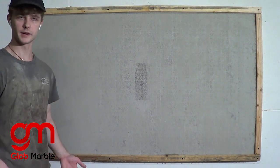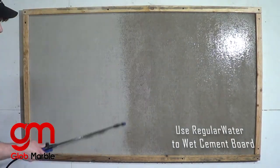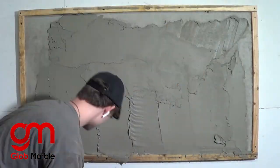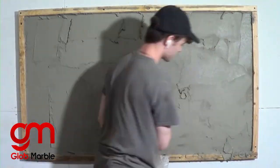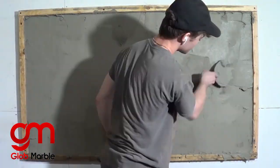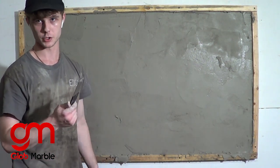Because I'm applying it to a cement board, I have to have it dampened before I start applying it or else it's not going to stick. Trowel on your thin coat with a heavy hand and don't be afraid to go too heavy on it. The next step is to make the ridges in your actual scratch coat — the best tool I can find is a hairbrush, but it works just fine.